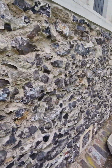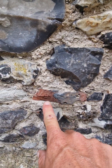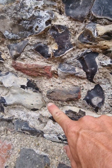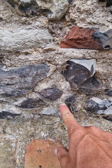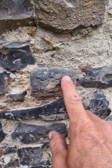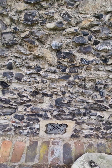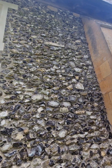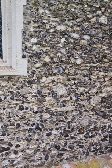And there are lots of lovely examples of clearly cooked brick — cooked brick, part of the same thing here. So you've got the steel brick and there it's taken on the charred colour. And a bit further down that whole section is the charred, cooked-out one — that's not flint, that's cooked brick. So you can see you're getting inconsistent flint and brick cooking damage, but nothing too out of the ordinary apart from the ghost arch and the bricks in this one.